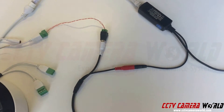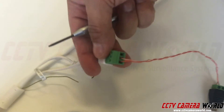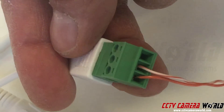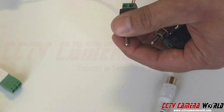Now I've got everything to take the audio, put it into the camera, and take the 12 volt power from the PoE and put it into the mic. Just to show you the leads — these are two simple wire leads. Make sure you strip the copper off of your cat5e cable; don't just plug it in expecting it to work. Expose the copper on both ends.